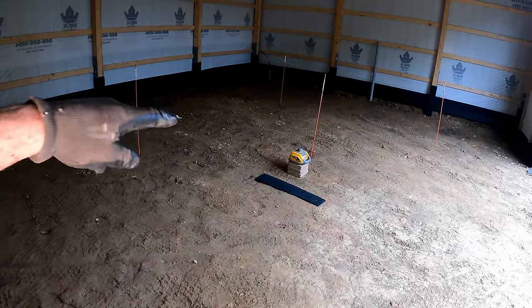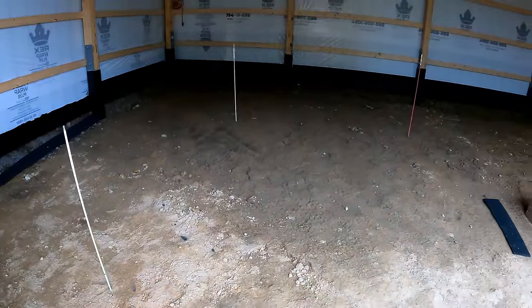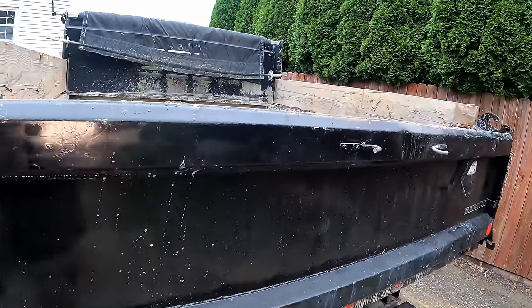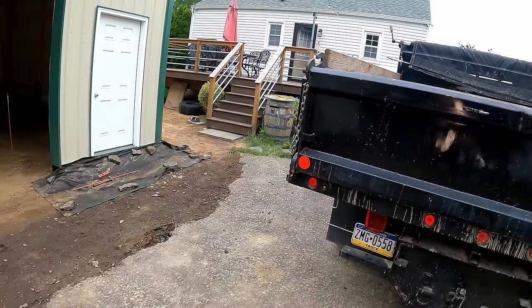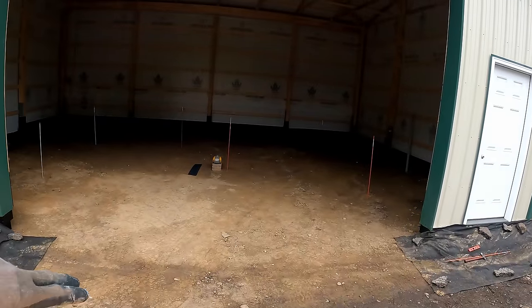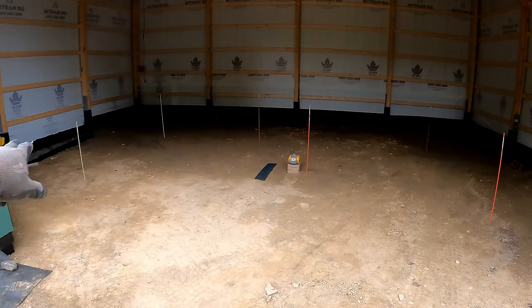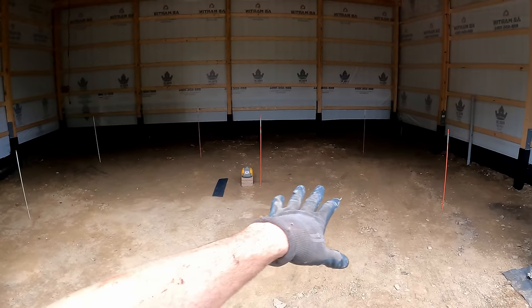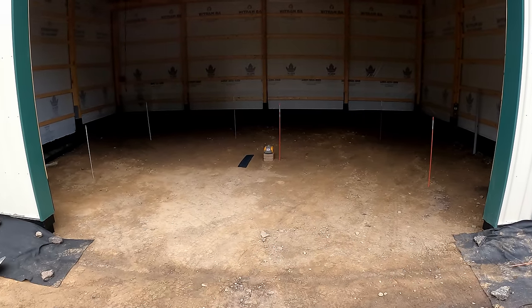We're keeping the water out of the building now, which is what you want for the subgrade. I decided to tar-coat the posts as well to prevent staining and water wicking up - probably a little overkill. This is the rubberized expansion joint - way better than the fiber boards, that stuff deteriorates super quick. This is recycled rubber; definitely spend the extra money and get that if you're ever doing a concrete job. I ran the laser level on this whole area and it's about to lay the stone out. Still have anywhere from five to six inches to fill, and I'm glad I let the building settle for this long because there's been no settling on any post - straight and true.